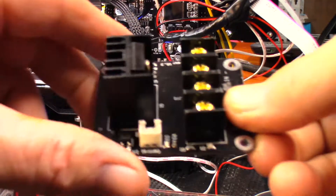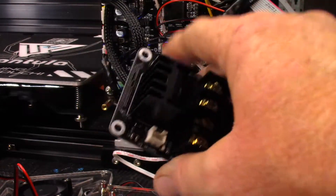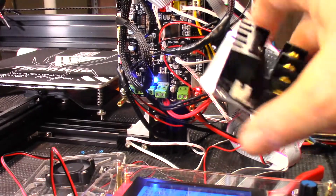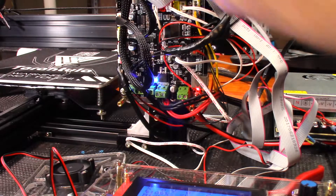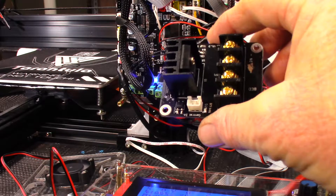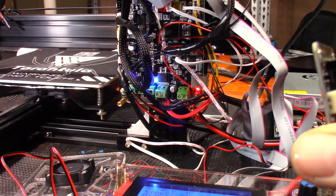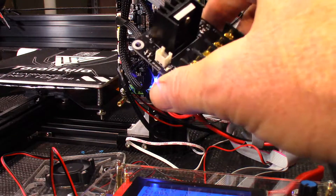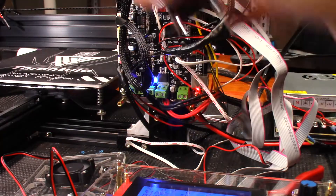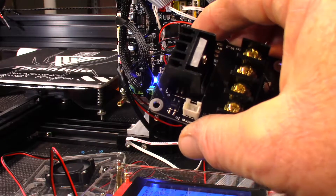On this MOSFET, I want to figure out a way of mounting it - probably underneath the circuit board. I think what I'm gonna do is slide the circuit board up on this frame and then fix the MOSFET on there. I'm going to go ahead and go over to TinkerCAD, design a quick little bracket to mimic the back plate of the circuit board, so I'll have a mounting point to get everything away from the metal frame.